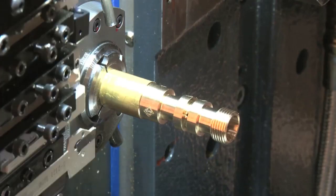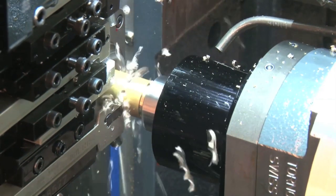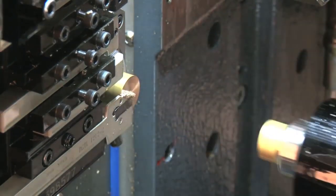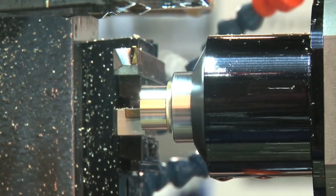And the spindles — tell me about those. You've got two spindles on this machine? Yes, the two spindles are identical. They're integrated motor spindles with 11 kilowatt power and very rapid acceleration and deceleration. Zero to 10,000 RPM in about 0.9 seconds — so very quick, very powerful, very strong spindles.